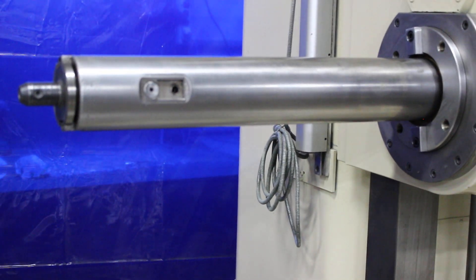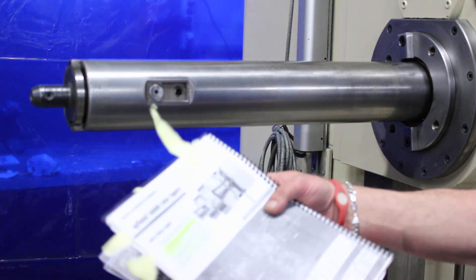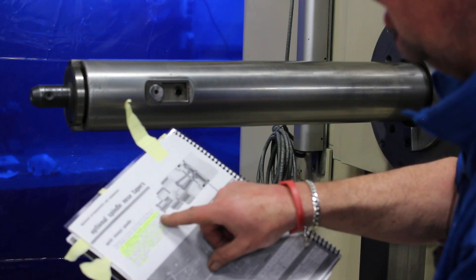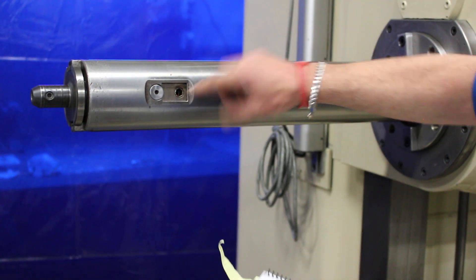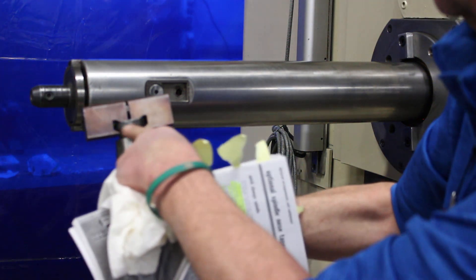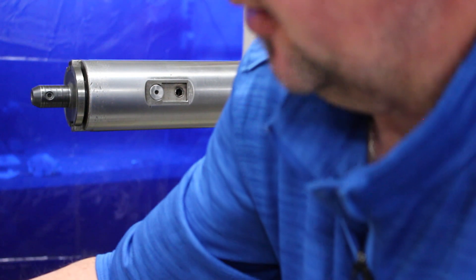What we call this here is a quick change spindle. A quick change spindle positively retains or ejects the shanks and cutting tools by means of a simple wrench adjustment, and that's the wrench adjustment right in through here. Right here is the Allen wrench, and here is one of the end mill holders that's sticking out — this is our sample of exactly how it clamps and holds it in there and then ejects it afterwards.